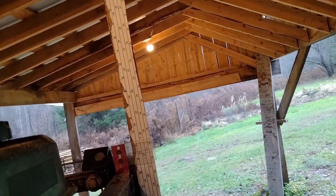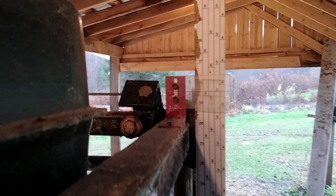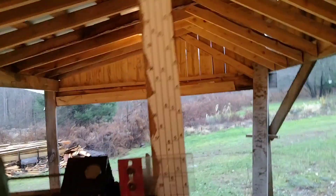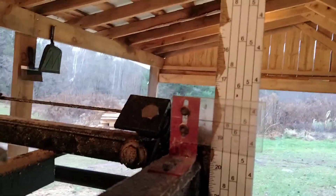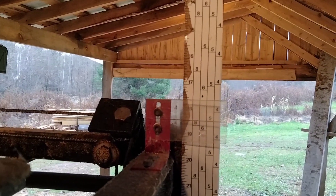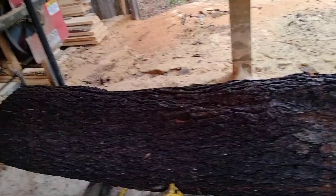Since our goal is six-quarter pieces, we're going to start right at six quarter on the scale. Now, if your mill head goes up and down on cables, you're supposed to drop below your target and then bring it back up. We drop below it and then bring it up to that six quarter. The reason you do that is to make sure you have no slack in your cables, because if you have slack in your cables, your head will ride up over hard spots. Our plan of attack is to just take this log down six quarters at a time until we get to the rot.